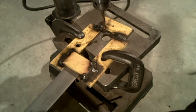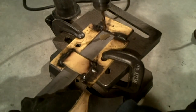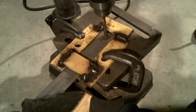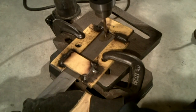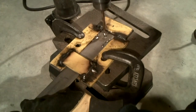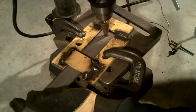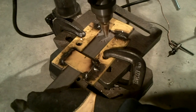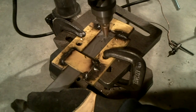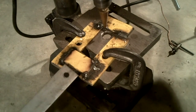I made up a jig that will safely hold the bar stock to the drill press. It allows me to consistently drill a pilot hole in the same location near the end of the stock. Since I have 480 holes to drill, creating jigs and templates is crucial for building an accurate hub. Once the pilot holes are drilled, I switch over to a step bit that will finish the hole at the proper size. I then flip the piece over and gently remove any tear out from the bottom of the hole.